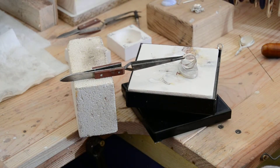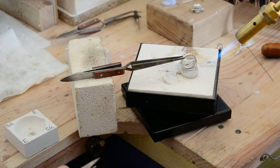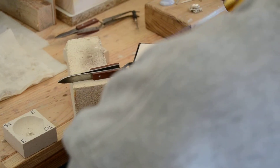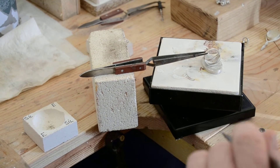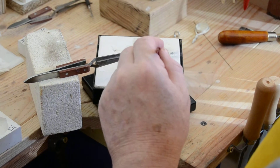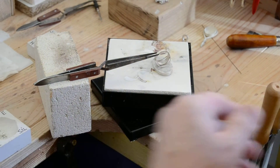Right, we're all ready to solder. I'm going to turn the light off and use the Sievert torch — no point in using the fine torch — and I'm going to use easy silver solder. I'm going to heat the whole thing up gently. I'll also put some easy flow flux on the places as well; this stuff does act as a flux, but just to be belt and braces.